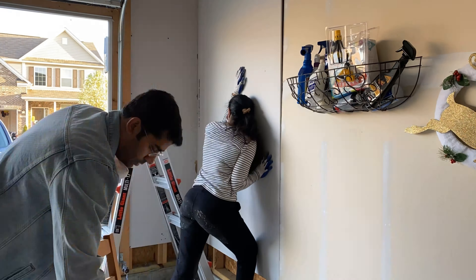We are trying to figure out how to install the whole panel without cutting it. What we are doing here is transferring all the stud lines onto this panel, so that when you put the panel on the studs you don't have to locate them — you already have the lines and can simply drill the screws along those lines. Does this make sense?